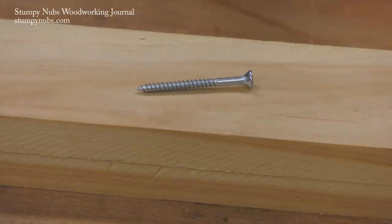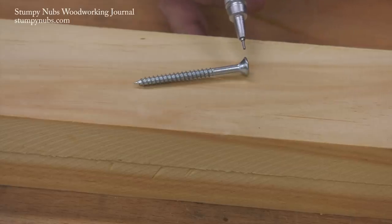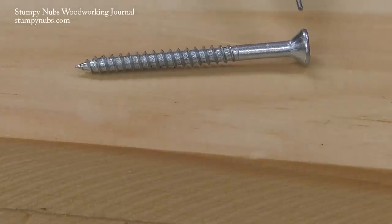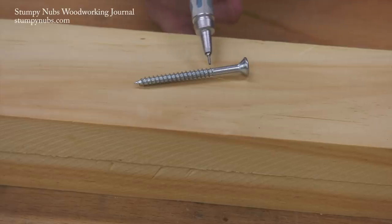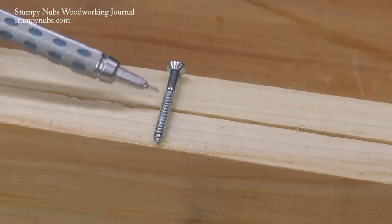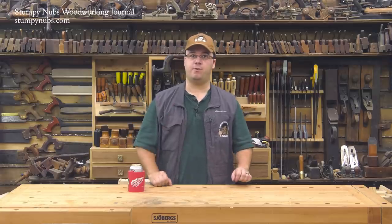This is a wood screw. Modern manufacturers slap that label on all sorts of different screws, and I'm not saying their screws won't work. But there's a reason this screw was designed this way and has remained unchanged for generations. The most striking detail is the partially threaded shaft. You don't want threads digging into the top workpiece, only the bottom one. If you have threads in the top workpiece, they may cause the screw head to seat before the upper and lower workpieces are drawn tight together. The partially threaded shaft is tried and true technology.